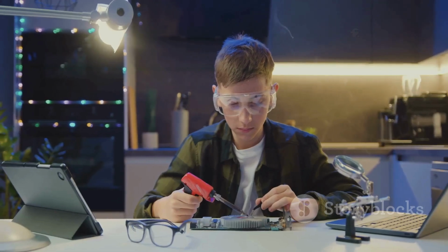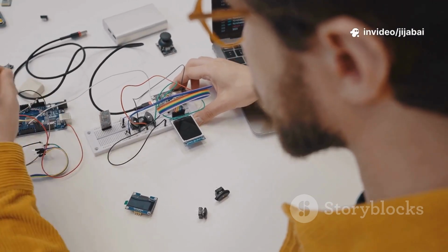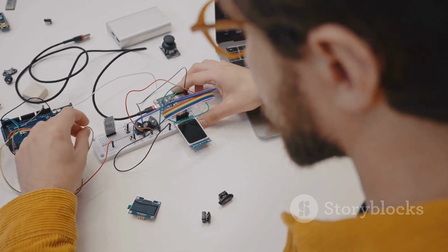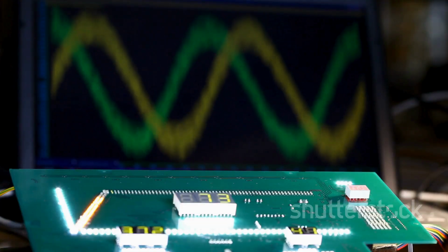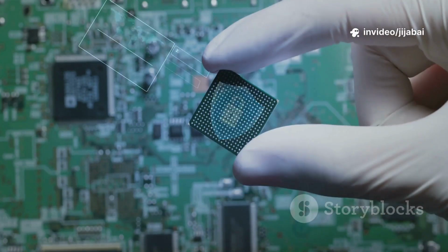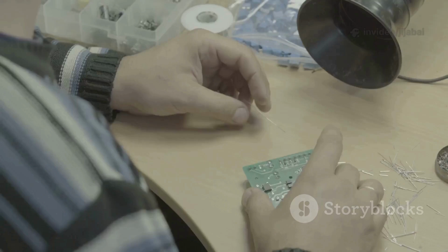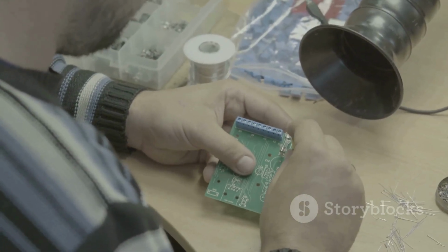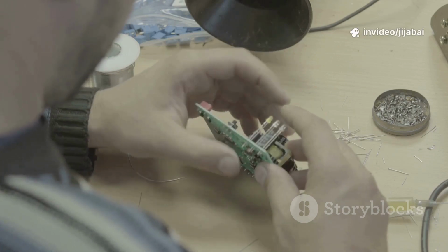The ease of building is a very important factor for a beginner. The 555 timer circuit is usually easier to build correctly on the first try. The connections are straightforward. The result is easy to see or hear. If your LED blinks, you know it is working. Troubleshooting is also simpler. If it does not work, the problem is usually a misplaced wire or a component in the wrong spot. The immediate feedback of a working blinker or buzzer is very encouraging and helps build confidence. This makes the 555 a great first step in practical circuit building.